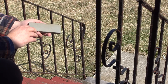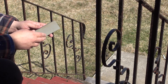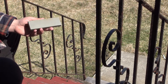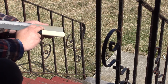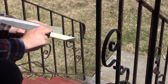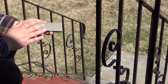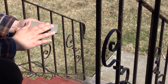Dramatically reduce your force to around 5 to 10 grams, barely making contact. Keep the stone very wet, and use a little bit of dish detergent, which reduces friction and allows the blade to glide over it. This is not the ideal stone for that style of knife — and you generally don't need or want a coarse edge on a knife like that — but if that's what you have, tilt the knife for maximum contact, reduce force, keep the stone wet, and add dish detergent. As a last resort, edge-trailing motions can work too, though they're prone to heavy burr formation.